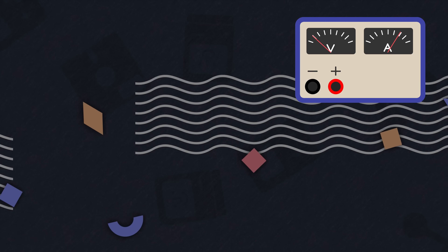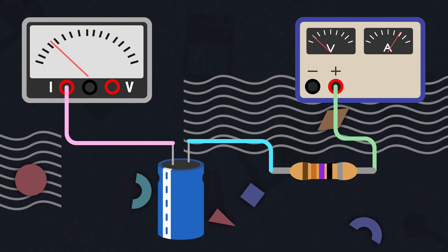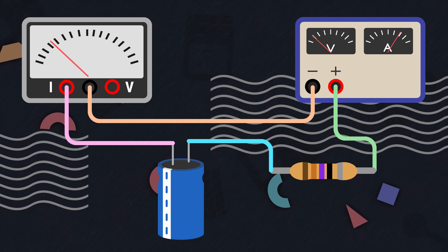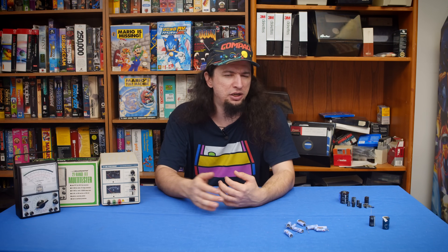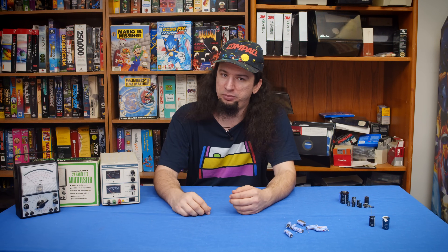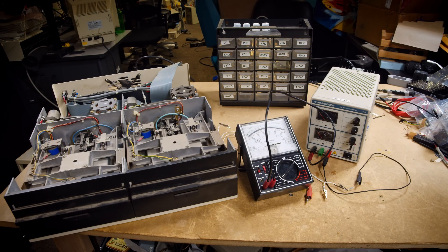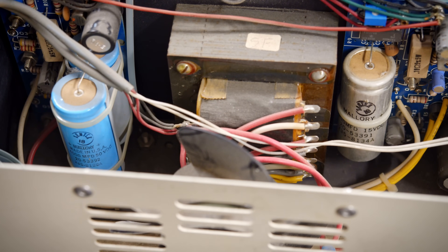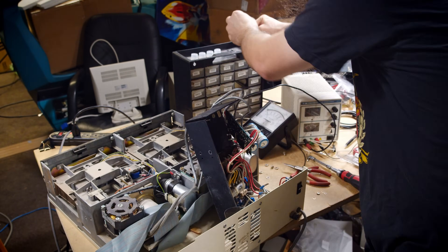The basic setup is: connect the output of the power supply to one side of the resistor and the positive terminal of the capacitor to the other. Then connect the positive side of the multimeter's current input to the negative terminal of the capacitor, and the meter's common connection to the power supply's negative side. The multimeter is set up to measure current at a low scale. You need to decide on what your limit for acceptable current is — the DoD guide recommends 5 milliamps, while I've been limiting mine to 2 milliamps. To demo this, I'm going to grab some caps from this dual 8-inch floppy drive — there are some in the power supply, and I especially like the pair of identical ones on the left to measure before and after.